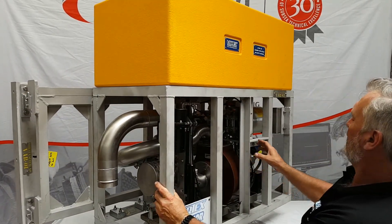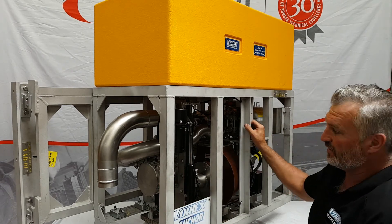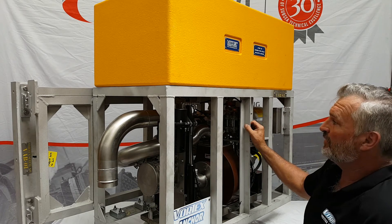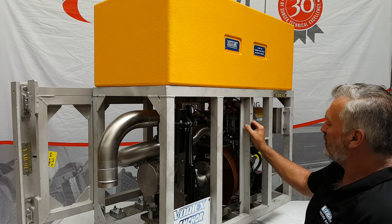Just little things like that — we try to listen to the ROV crew and make the job easy for them. I'm an ROV guy myself and we want manufacturers to listen to us and bring those ideas into the tools in the field. On the installation side of it, we've got flotation that comes with the tool. The whole tool as you see it here weighs around about 12 kg heavy in fresh water, so essentially in salt water it's around about neutral buoyancy, plus or minus a few kg.